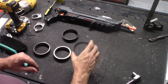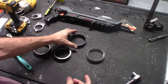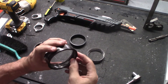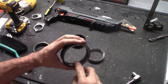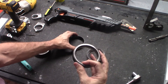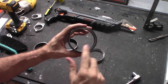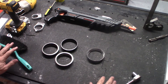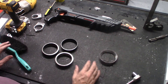The other lesson I learned: don't compare everything to just one example. There are at least two different styles of these rings. This one here is a significantly beefier style — it still has the same first set of features, but the outside feature has a much shallower angle and a lot more leftover material. This one would actually be a lot easier to make. So I think on the second one I'll try doing it this way — I don't know if I'll bother filming that, but once I get one done I'll do a little comparison and we'll see if it actually works.